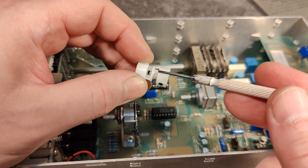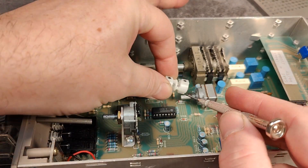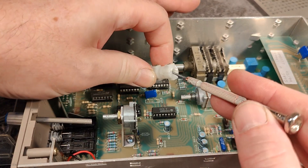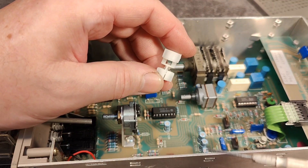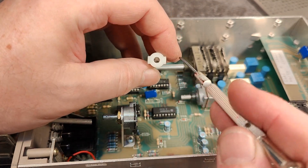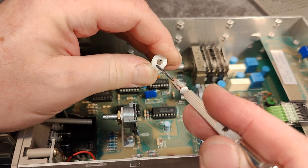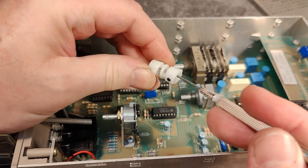But I want to make this much more 3D printer friendly, so I want to make V-cuts so I can 3D print it. Also, the length of the original one is a problem — why not make it longer so it touches more of the shaft on both ends? That will make this part much better. I want to 3D print it standing upright, which also supports making these V-shaped cuts. I'm going to go for PETG — that is a really strong material for something like this. They chose nylon, but nylon can be brittle.